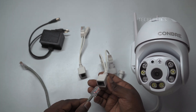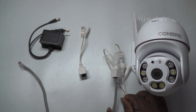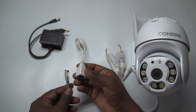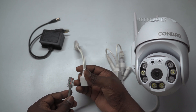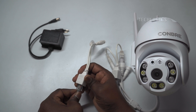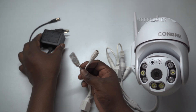Connect the male pin of the DC input connector to the camera side's DC pin and Ethernet port. On the PoE injector connector, connect your cable to the appropriate side. The other end of the cable should be connected to another part of the PoE injector. This side's DC female pin should be connected to the provided DC power adapter power supply.